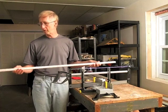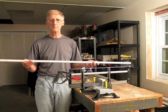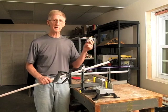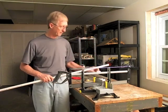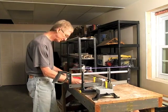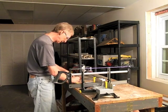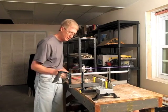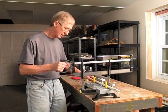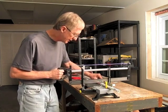In order to make the framework, I'm going to use a one-half inch PVC pipe. I've got about a four foot length here. I'll cut this into four 12 inch lengths and then I'll connect them together with these elbows. So I'll go ahead and cut off the first length at 12 inches. The miter box works well for this because you can make a nice straight cut using it.